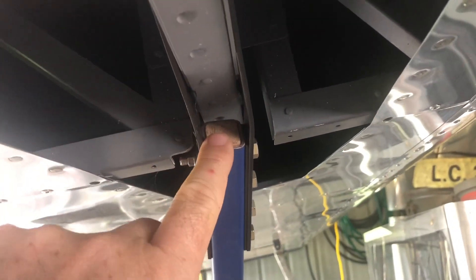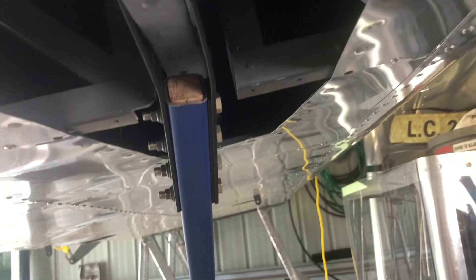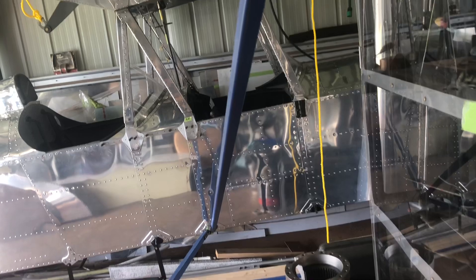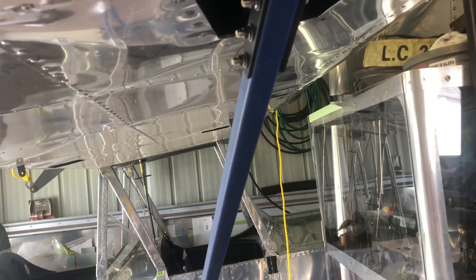There's the upper mount. I put a little timber filler on the inside here, just like an anti-crush thing. I like to do that with all the tubes with bolts going through them. The front one's done, correct length anyway. There's obviously trailing edge and leading edge to attach, and jury struts and everything yet.